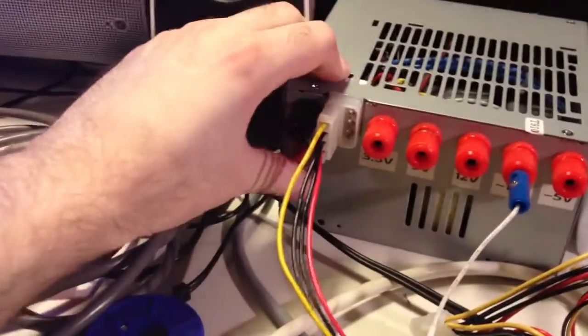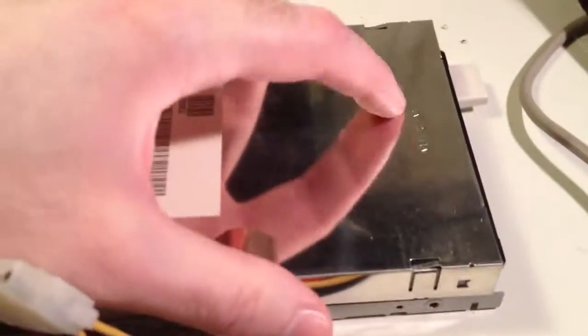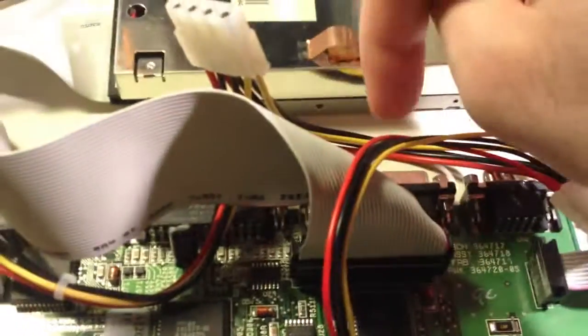Let me turn on the power here. This disk is not write-protected, so I put that in there. I have a Workbench on this disk. Now the beauty with Amiga 1200 - this is a working Amiga 1200 motherboard by the way, working perfectly fine, no problems there. With Amiga 1200, and many other Amigas as well, but not with Amiga 500 for example, you can connect an external drive and then go into the early startup menu, and then choose to boot from DF1.